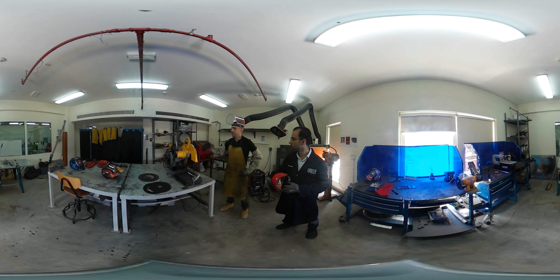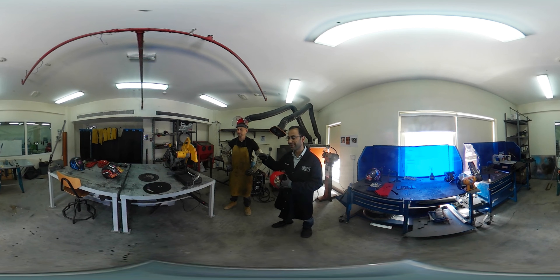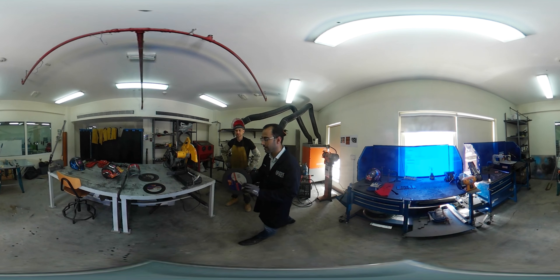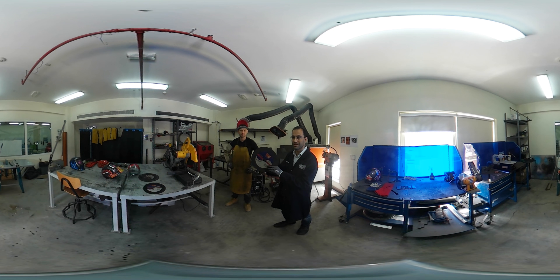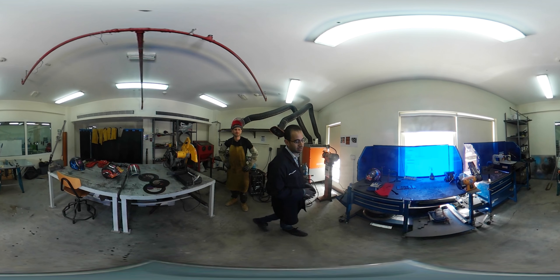Different shapes of material will cut in different ways, so as long as you are not using what you would consider excessive force, you should be okay. Another tip: really listen to the motor. Motors are designed to run at their rated RPM. When they start to slow down, you will hear it in the sound from the motor. You don't want the wheel to stop under pressure, because as you release, the motor tries to rotate again, and any tiny chip on that wheel could initiate a crack and a shatter. Always ask if you are not sure.